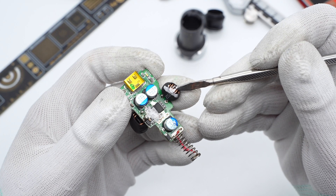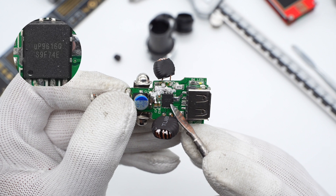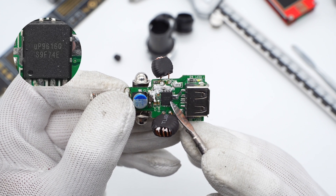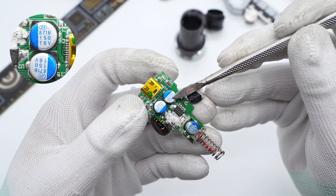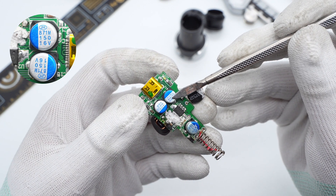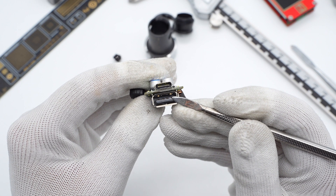Here is the step-down inductor of the USB-C port. Turning to the back, the controller of the USB-A port is from UPiSemi, the UP9616Q, which is also a step-down converter with built-in protocol identification. Two solid capacitors from Jianghai, rated 150μF and 16V, are used for the output filtering of the two USB ports. Finally, the two USB ports are soldered on the front and back of the PCB.